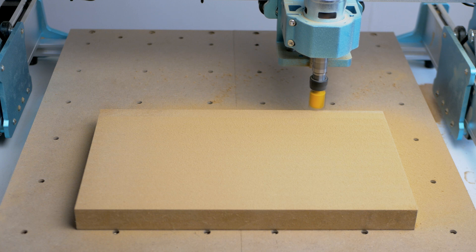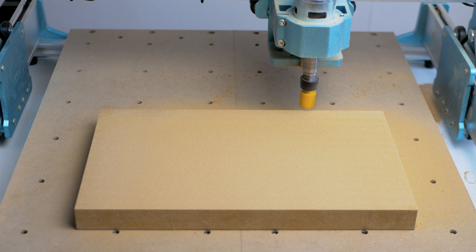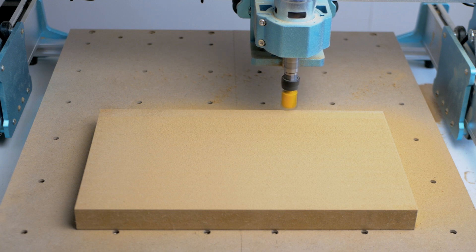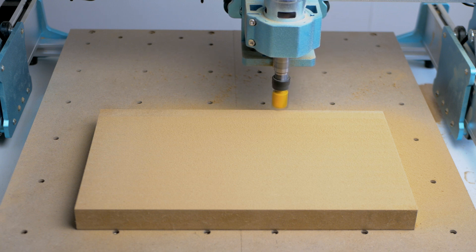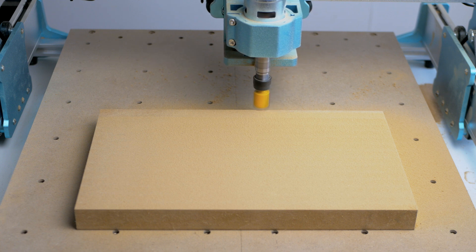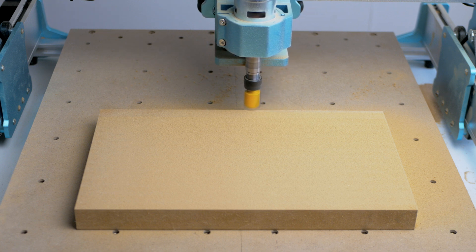With a bit of time we get the job done and it leaves a nice finish. I'm just going to pop up an example of what a board looks like when your spindle is out of tram. If you find prominent ridges you can feel on the bed, it means your spindle is at an angle and needs to be adjusted to square it up to the bed. Check out James Dean Designs for some excellent guides on the topic and just all-round excellent content on CNC.